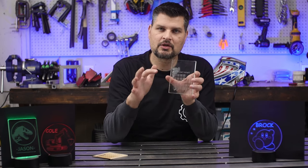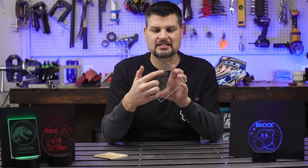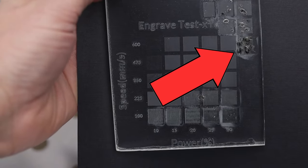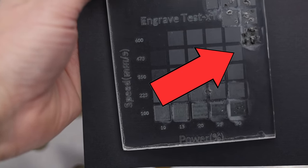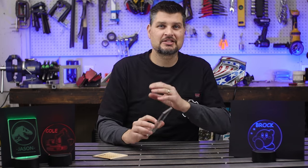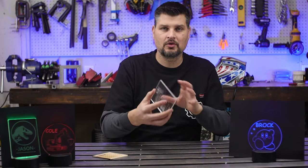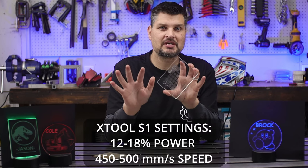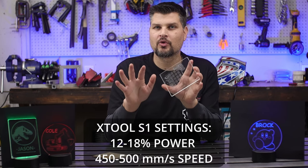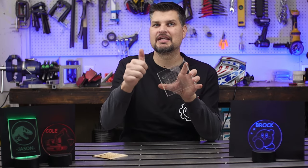So I will tell you my settings that I'm using — just know you may need to adjust them a little. The one thing with acrylic is if your settings are too hot, it will boil and actually cook the inside of the acrylic. You don't want that, so go on the lower end. You'll be surprised that you don't need that much power. I've found that about 15% power and about 450 to 500 millimeters per second speed is right on.